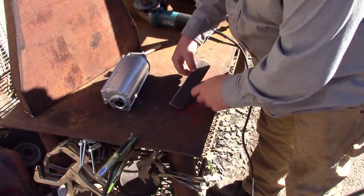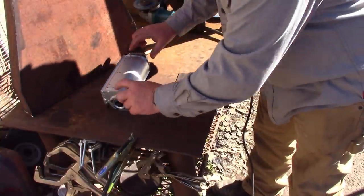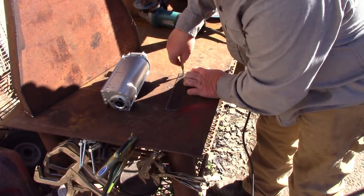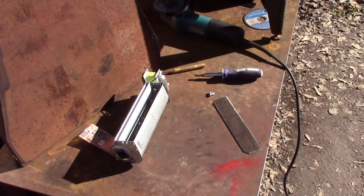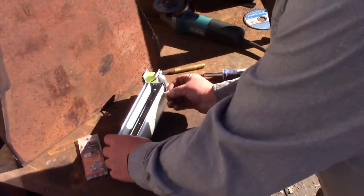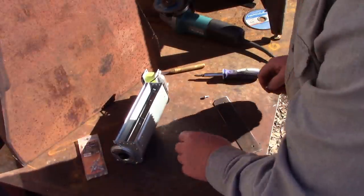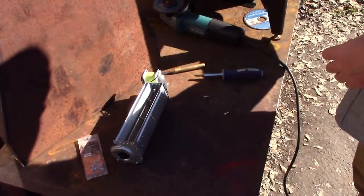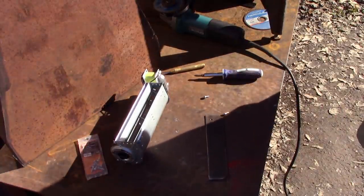This is going to be the back for the blower, and it's going to mount just like this and be welded on. I've taken the two top corner holes and transferred those marks here, so I'm going to drill these out and find some screws that fit in those holes. I found some little sheet metal screws in the shop and with the proper persuasion they fit in there perfectly. I'm good to go ahead and mount this plate — just going to tack it up onto the heater.